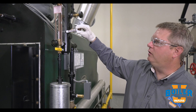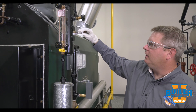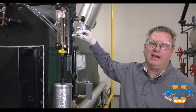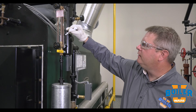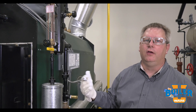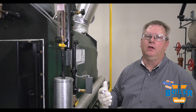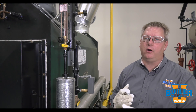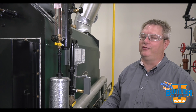So I can either reference a portion of the sight glass column — like the top of this casting — or I can actually mark in some fashion the level for future reference. But the most important thing is to be familiar with that normal level so that we can come in and instantly know: yes, that's the right amount of water, or we're overfilled, or there's no water in the sight glass.